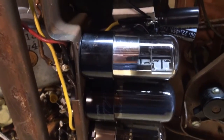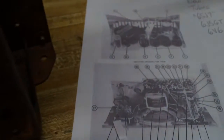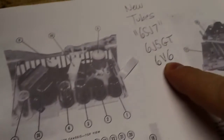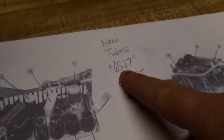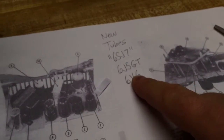I had done so, but it didn't bring it back to life. I was thinking maybe I need to go the route of resistors, but in this case it ended up being this tube right here — which is still really hot. According to the schematic I purchased from the Sam's PhotoFacts website, I believe that's a 6V6 tube. So the 6SJ7, the 6J5 GT, and the 6V6 are all new tubes, meaning there's really only one tube in here that I have not replaced.